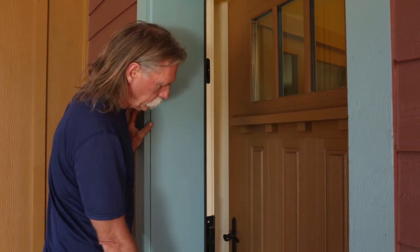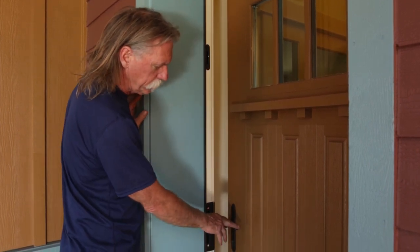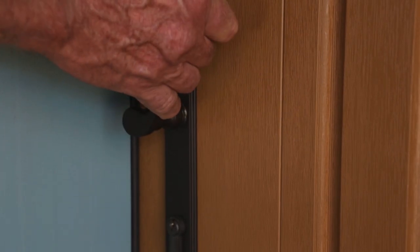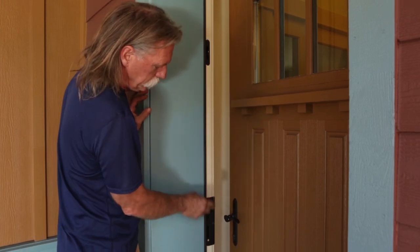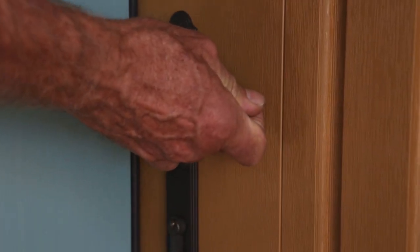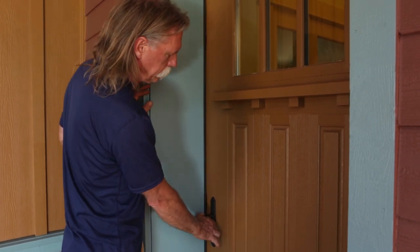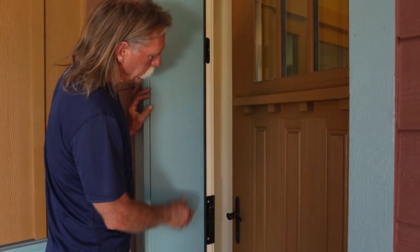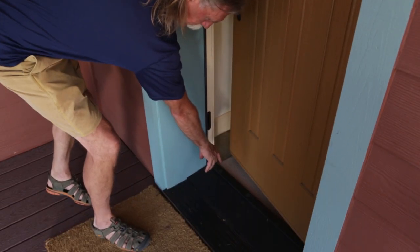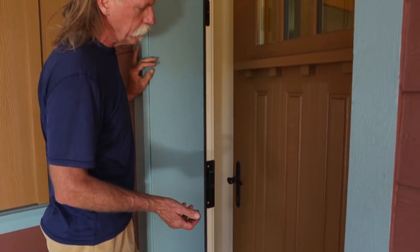This is our front door for this house. Thick walls, so now we have a great big 12-inch door jamb. Instead of a conventional locking mechanism that just latches in the middle, we've used a triple-point lock which latches at the top, the middle, and also the bottom. On these type of locks, you hold the door closed and engage the locking mechanism — it's a lot better seal than on a regular door lock. It's also critical to make sure that your weather stripping is good, and down here at the bottom we have an adjustable door sill. You can adjust that and make sure we have a good seal at the bottom.